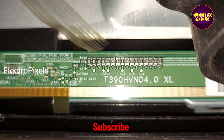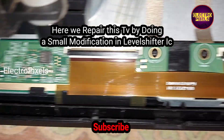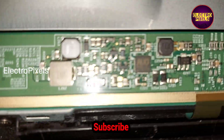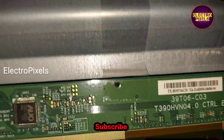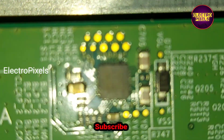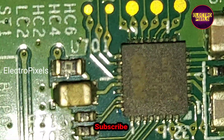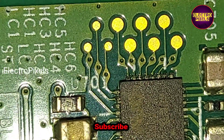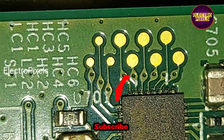Here you can see the panel model number. In AUO panels, you can see LC1 and LC2 named test points, also called VJ odd and VJ even test points in LG panels. In AUO panels, these LC1 and LC2 test points will show both VJ odd and VJ even voltages simultaneously as a pulsing voltage — if VJ odd voltage is in LC1 then VJ even voltage will be in LC2, and vice versa.